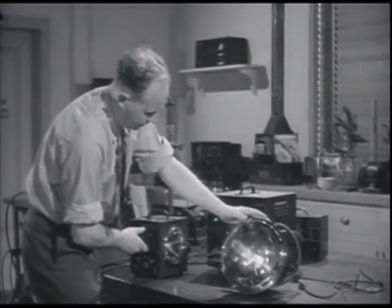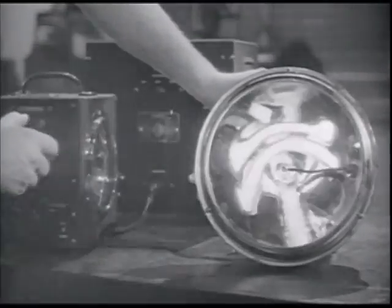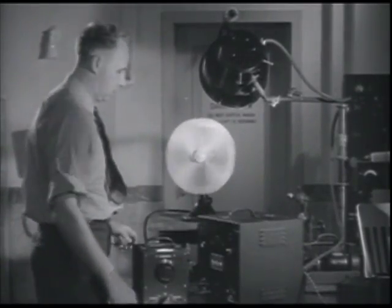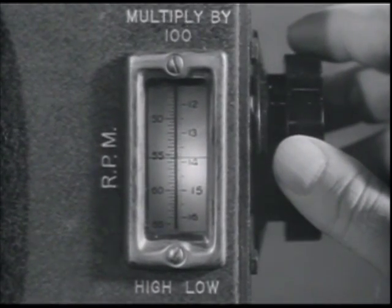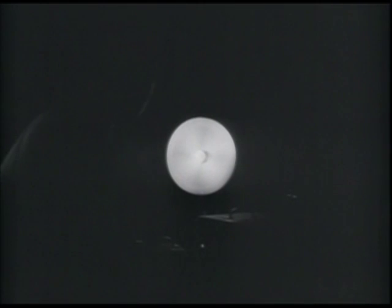The principle of this high-class gadget is a light that flashes on and off at variable speeds. Through this invention, you can examine machinery in motion. A common electric fan is used in a simple demonstration. When you direct this light on a fan and synchronize the light flashes to the revolutions of the fan, the blades appear to be stationary. To make sure they aren't, it's better to turn an ordinary light on the fan than to stick a finger into it.